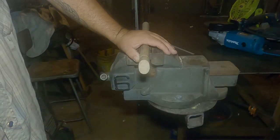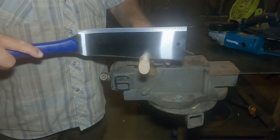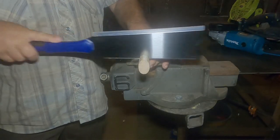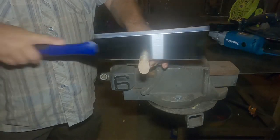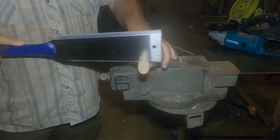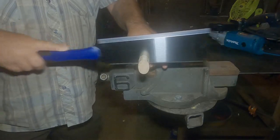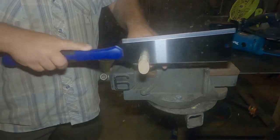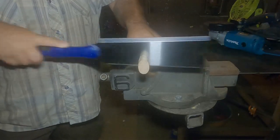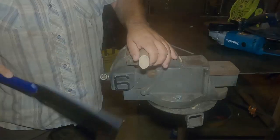When I was cutting the axe head off, I flexed the blade several times doing that. It's not really harmful to the saw, but the best way to avoid doing that is to just slow your cut down. You don't have to put any pressure on this really — I've got one finger laying on top of the handle. As you slow it down, you can keep that blade tracking straight.